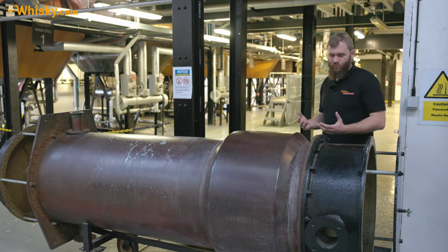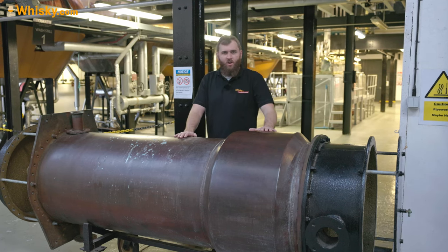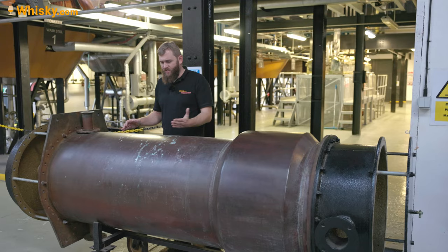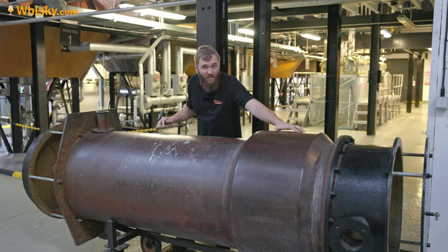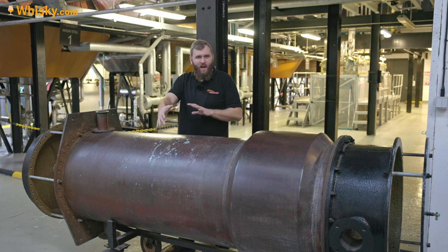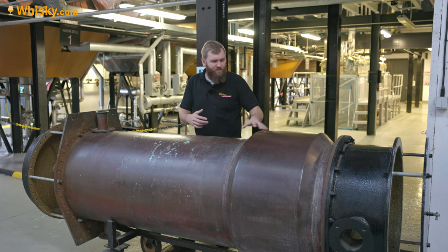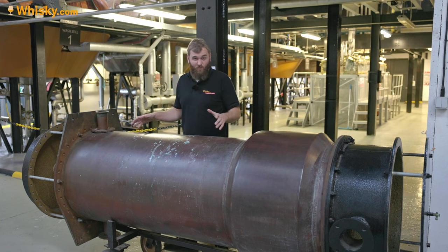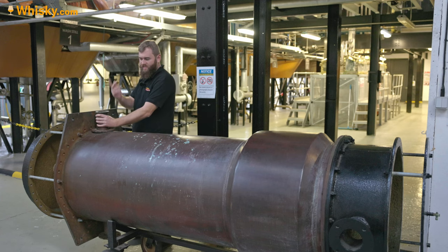The water comes straight from a very cold river, so the tubes are very cold and the alcoholic vapors condense on the tubes and drip down. With newer condensers you can see that the top part is still pretty hot and the lower part is already pretty cold. Because the top part is very hot it oxidizes really fast and will color darker pretty fast. Here you can't see it because this is an old one and it's already fully colored.